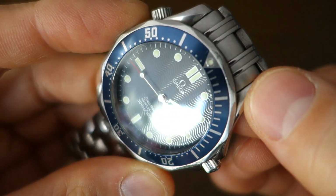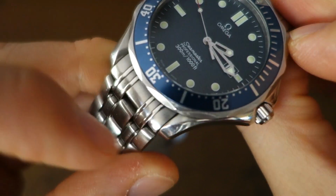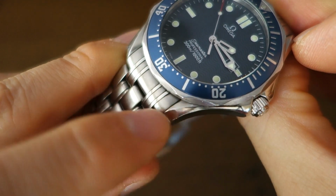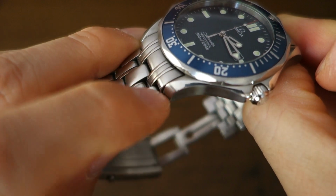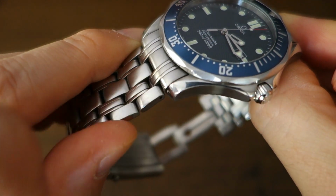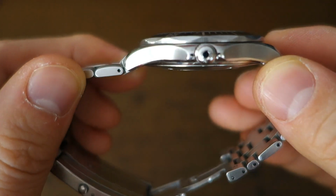The top surface of the lugs inside, it's going to be hard for me to show you, but there's actually a bit of a radial brushing pattern here. But of course, most of this is actually this beveled edge here, which has the polish. So there's a well-known kind of Seamaster case finishing, which is well loved, that knurled type of shape there. And then it transitions onto longitudinal brushing on the side.